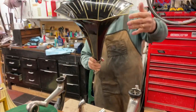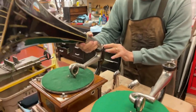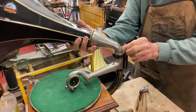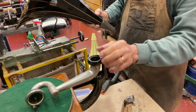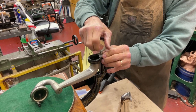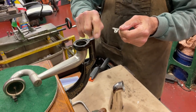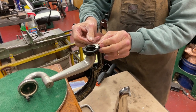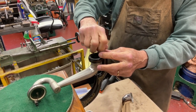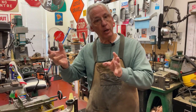Now when you turn it around and have it sitting in the machine — put this one back in the machine — the decal is in the right position. This bracket here, this Y-shaped thing, is unique to all of them from the Victor 2 up, and these are interchangeable. It has a pin here that fits in the back bracket. You'll set this in here, and then we have this hole for the threaded part and you'll screw this in. Leave it a little loose before tightening it down — it's easier to put the horn on.